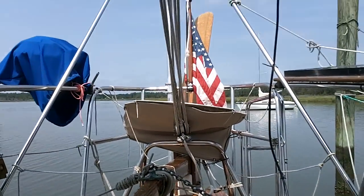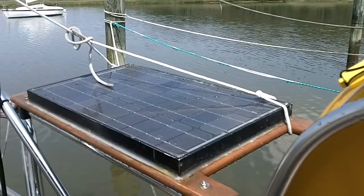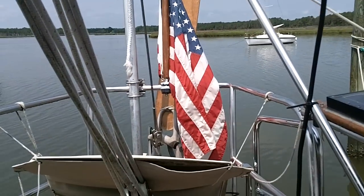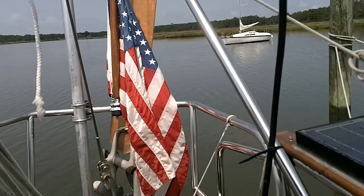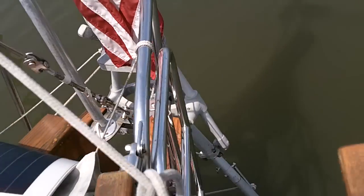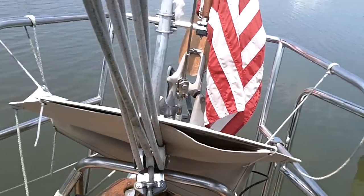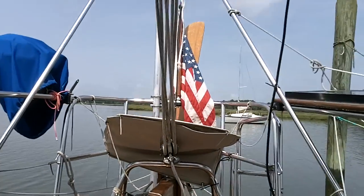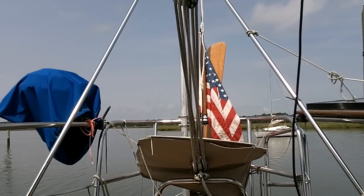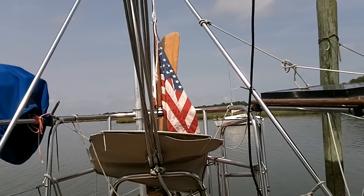Looking back here to the back of the boat — Heidi loves to make fun of this in terms of the Beverly Hillbillies look. There's a lot of equipment: a solar panel, engine for the dinghy, propane grill, flag in the back. At the very back, I want to point out a really cool piece of equipment — this is a wind self-steering vane. That board up there is connected to a mechanism, and it's attached to a rudder in the water. Once it's set up and the boat's sailing a course relative to the wind, if the boat deviates, that wood lever goes to one side, which causes the mechanism to rotate, which causes the water rudder to go to one side.